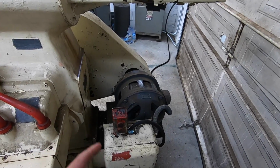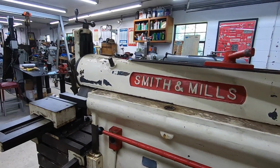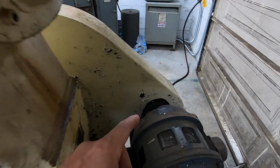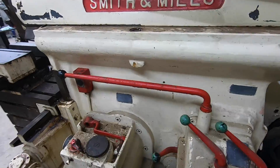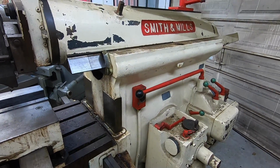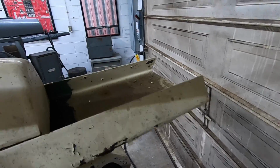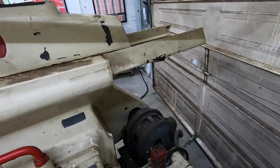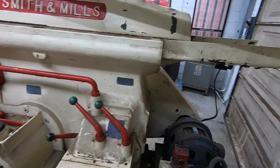That's why the contactor there was kind of a slow starting motor, and I could tell that we weren't getting the power here. I could tell that it was slowing down on the return stroke, and I could actually look over and see the pulley kind of bog down a little bit on the return stroke. Not only that, our rapid was not working either. You know, we could hear it buzzing. So all that led me to believe that this was a high voltage wired configuration, and in fact it is. So I have installed a 480 volt receptacle over there, and so I can plug it into a dedicated receptacle there just to run it where we're at right here. So let's go ahead and fire it up and you can hear the difference.